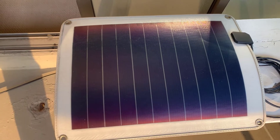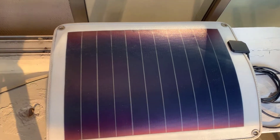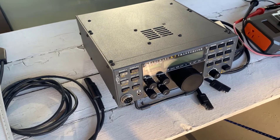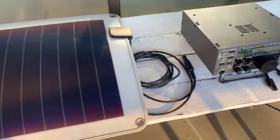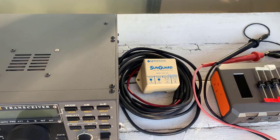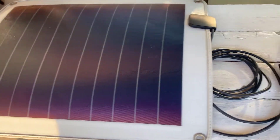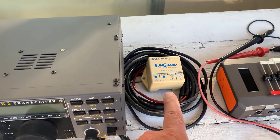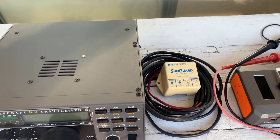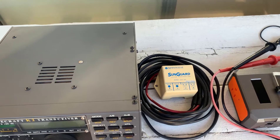This panel here is a Uni-Solar 10 watt panel, which I purchased about 20 years ago. I used it to trickle charge — this is my HF transceiver, it's a K2, and it has a 12 volt gel cell inside. The panel came with a Morningstar solar charger. This panel produced, I think, at maximum up to 28 to 30 volts. So to get it down to a charging voltage for 12 volts, it used this particular regulator. This is a PWM regulator, similar to the one I had on my Land Rover 30 years ago. What it does is it switches the voltage on and off so that the average voltage is around 13.5, which is what you need to trickle charge the battery.